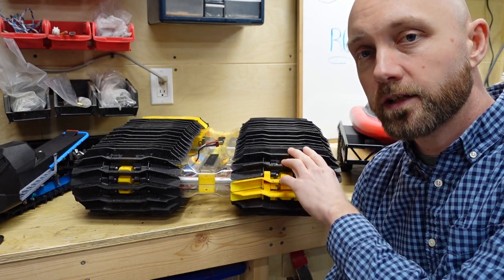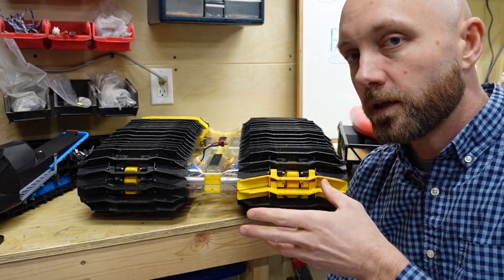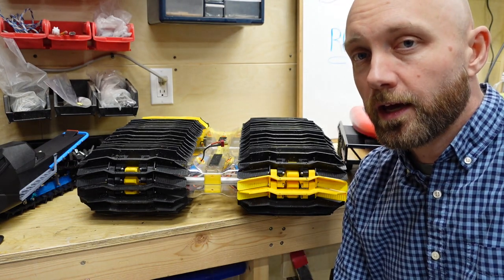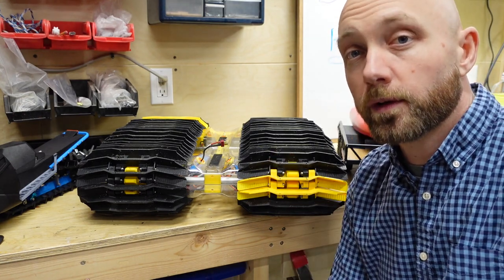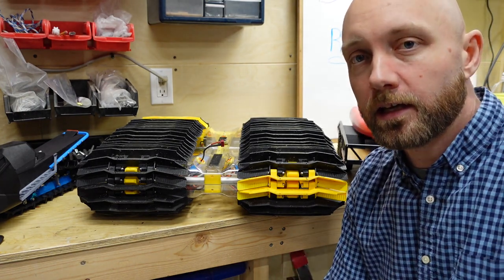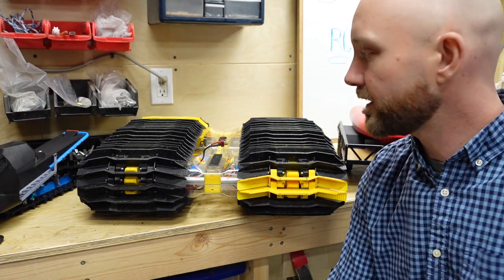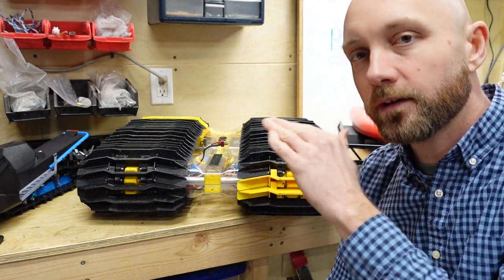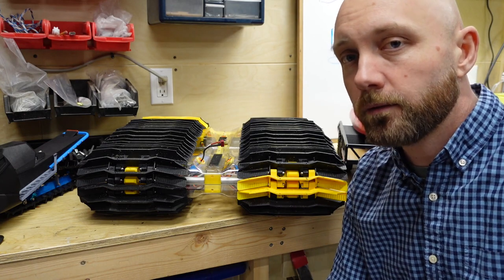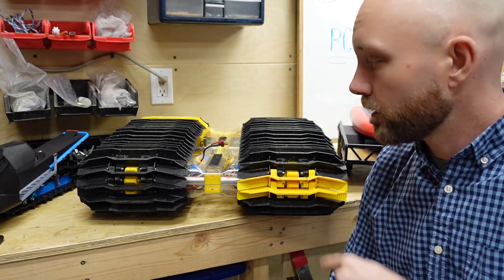The kit comes with injection molded plastic tracks, but all the yellow interior pieces, drive wheels, and TPU guide wheels need to be 3D printed. It also comes with a polycarbonate shell, metal axles, and all the electronics you need. The only real issue I had was that the ESCs originally included weren't great, so we upgraded those — and otherwise I couldn't be happier with the result. It's super beefy, runs really well, and can take a licking and keep on ticking. This is definitely one of my favorite RC projects so far. For a tank it goes pretty fast and can even run upside down with batteries strapped to the top. I was hoping to house some FPV equipment in there and go driving up a mountain just like Dan does in his videos, but that's new tech to me, so we'll take it one step at a time.